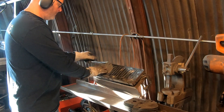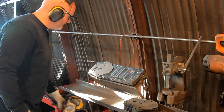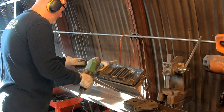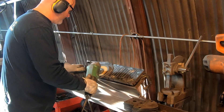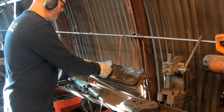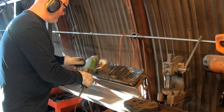The sanding of the parts after knocking off the slag is pretty simple. A good angle grinder and a flap disc looks amazing. Everyone always asks about my little magnetic table for holding the parts while sanding — it's the chuck off of a surface grinder. I'll put a link in the video description below so you can snag yourself one. They are the bomb for holding steel parts while you sand them.